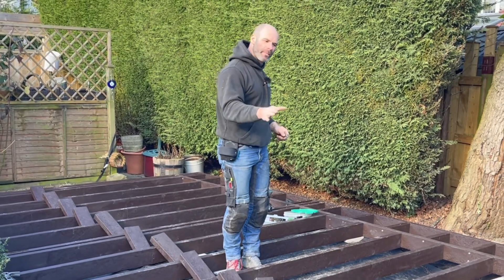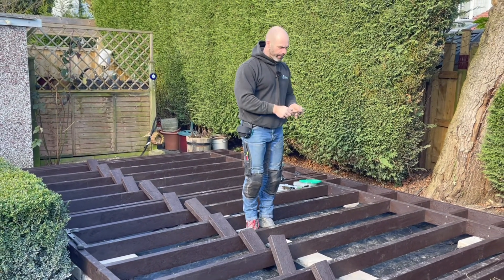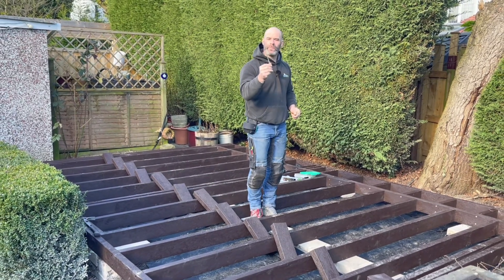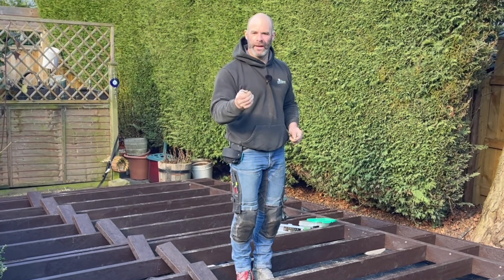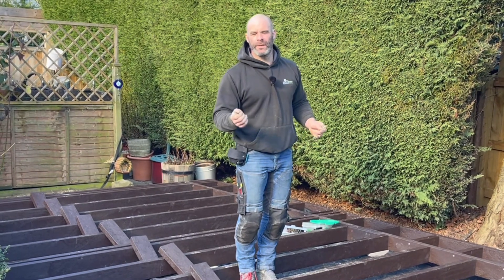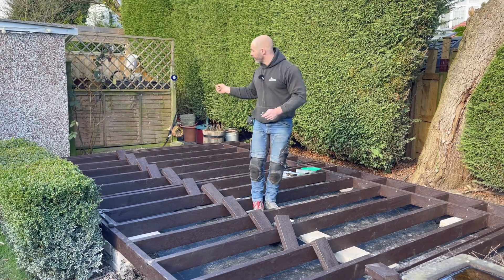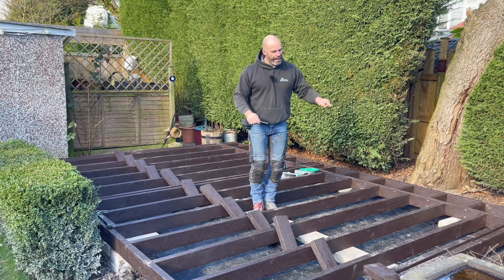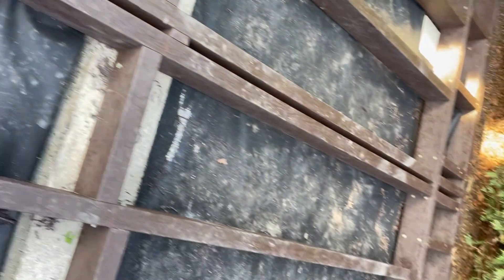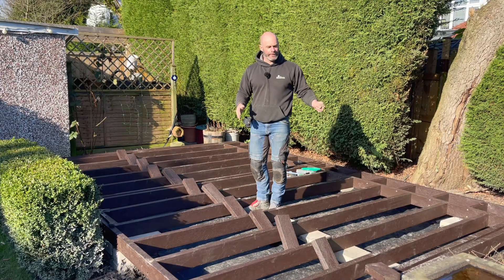We've spent a day or so now just assembling this frame and it's pretty much there. I just wanted to talk about one or two of the details. First off, we've fixed it all together with these — they're 6.7mm thick, 100mm long, very heavy-duty construction screws. We've used thousands of these over the years and I rate them very highly. You do have to pre-drill them with this plastic product, but that's part of the nature of the beast. All the joists are set out at 400mm centres, with the exception of a couple of areas. At each end there is a triple-joist detail to carry the picture frame — that will make sense when we come to fit the deck. There's a pair of joists strategically placed to carry the end of each deck board. The deck boards are 4.8 metres long and the deck is longer than 4.8, so there's going to be a staggered joint pattern.